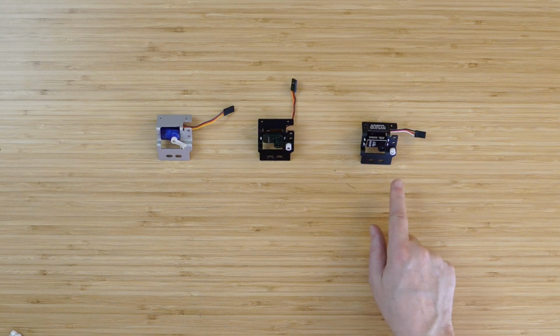Weakest, strong, strongest. This is the one that's important to me. You may have seen in other pen plot videos that I have this jam jar on the top of the pen. The reason for doing that is that there's no downward pressure to force the pen down. With a pencil and some other tools, having downward force really helps, like these Posca pens that you really need to push down on. With other various pens, particularly ballpoints and gel pens, and especially with these white ink pens, they're prone to skipping and sliding without that additional downward force. So why not use a load of extra weight or elastic bands or springs? Well, because the default servo isn't strong enough to then lift the pen back up.